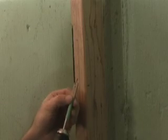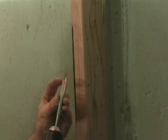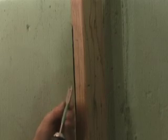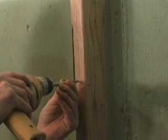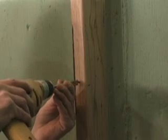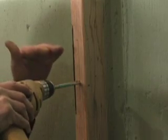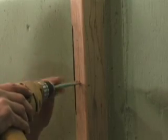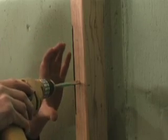Now, I took my tape and I put it at 1 1/4 inch thickness from this point here where it's going to make the bottom of the hole flat. Now, what I'm going to do is drill a multiple set of holes, but they can't overlap, because if they overlap, they're going to start running into each other. So I want to keep the holes separated enough so that I still have solid drilling material to go in.